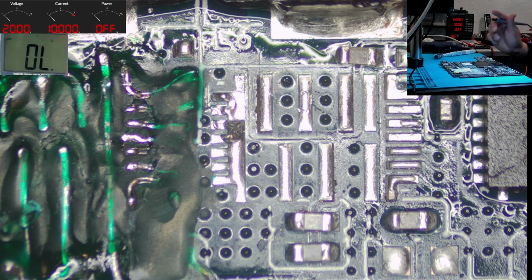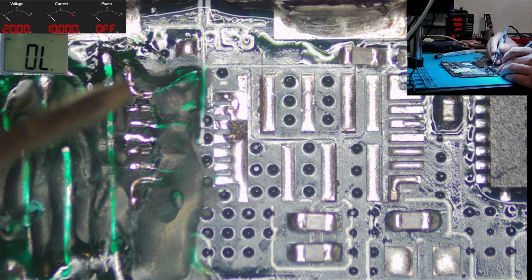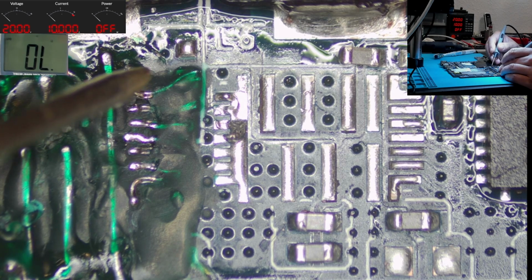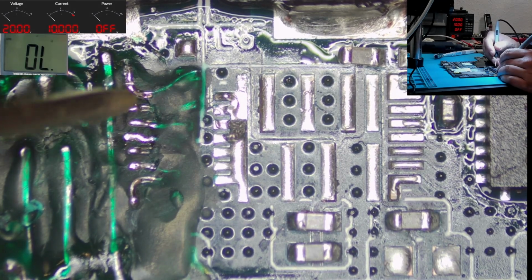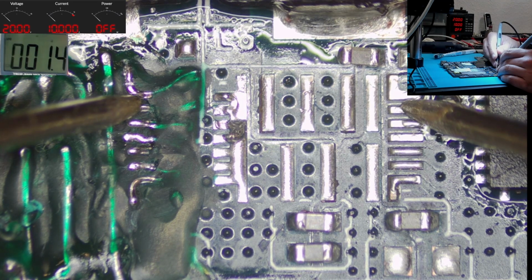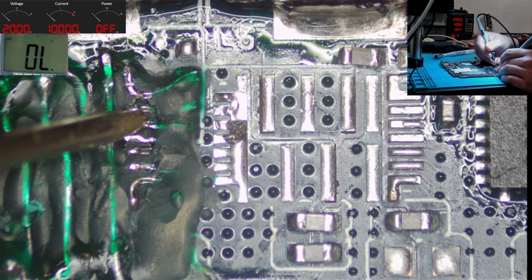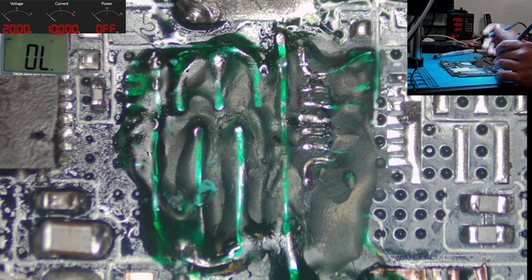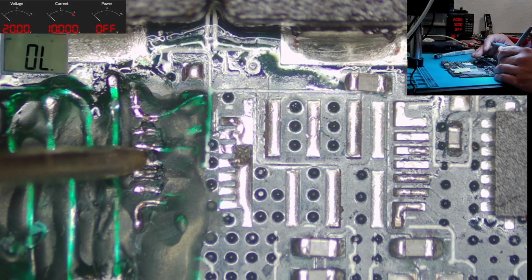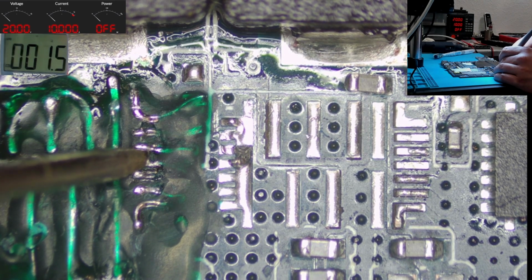So let's check whether all pins are soldered properly. We have bootstrapping here, which is an internal pin for the DrMOS. Then we have VCC, which is a 3-volt supply. We can check for continuity with here, and we do have continuity. When the current sense pin here has continuity with the controller, then the VTemp pin here. Yes, this is our VTemp pin. So the top pin is actually our current sense pin here, and we do have continuity with the controller.